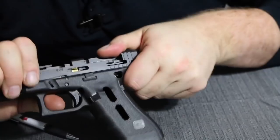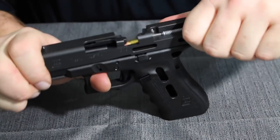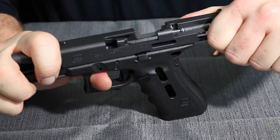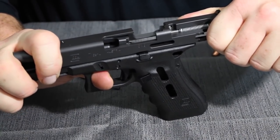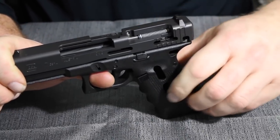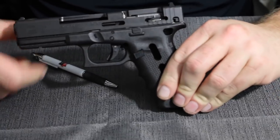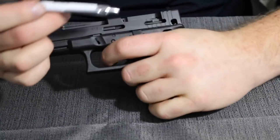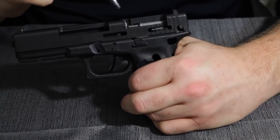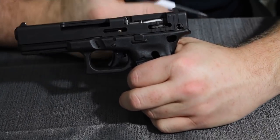Now we're going to flip it over and through this notch here you're going to see how the ejector works. The slide comes all the way to the rear and strikes the ejector — extraction ejects the fired cartridge case. Strip a new round off the magazine. Everything re-engages. We're locked, we're ready to fire the next round. And as you can see, now that I released the trigger, all the safeties are re-engaged: trigger safety engaged, firing pin block engaged, connector, and the drop safety is now engaged.